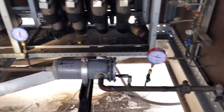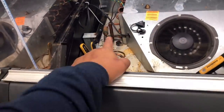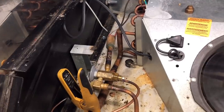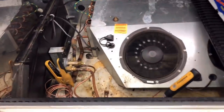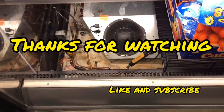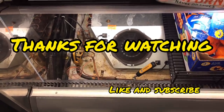We're back at the case with probes hooked up. I set the valve to the midpoint to start. My co-worker is going to the rack to override the EPR valve to 35 PSI and we're going to see what our saturation looks like at that setting. 35 has worked really well in the past. We're going to leave it for now — I don't see it causing an issue with the EPR being overridden.